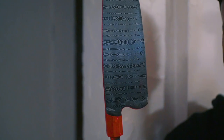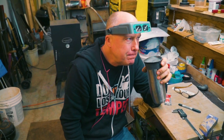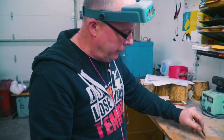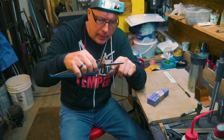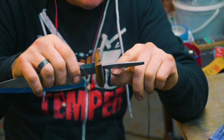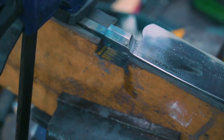I'm going to put fingernail polish on my knife — stick around to find out why. Coffee break. This is a diffuser plate off of a computer. I got a little too much drop in my tang. I'm going to get it right on the next one. This is good, but I can do better. Put fingernail polish on the bolster because we do not want to etch that. We are going to buff and polish the bolster on the spine, so I'll put a nice bright red fingernail polish on that and a little bit of the spine and heel also.